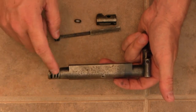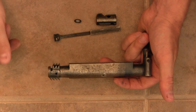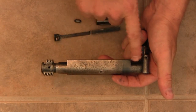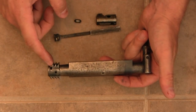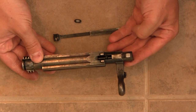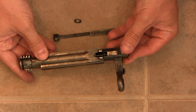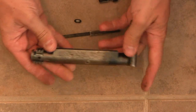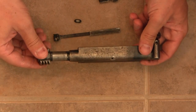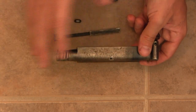When it's all the way back, the locking lugs are supposed to be vertical to lock the gun. If I take this out and just over-rotate it slightly, now it will go back to its full length with the lugs horizontal. What this causes is the bolt going fully forward without the lugs actually engaging in the barrel extension and locking. Once the bolt's fully forward, the firing mechanism doesn't realize that the gun is out of battery, and if I pull the trigger in this configuration it will drop the firing pin and detonate the cartridge. It's actually, to my surprise, a bit easier to misassemble the bolt than to do it right if you've got the whole thing stripped down.